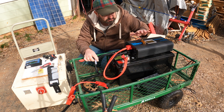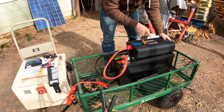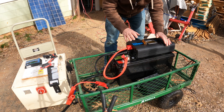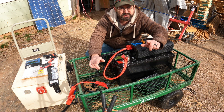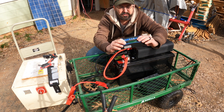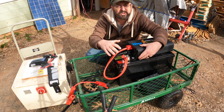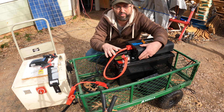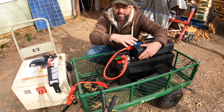We are now done with the system — we have a complete system. We can turn this on and power this unit. We could plug things in and we'd be good to go, but we have to charge it first. Remember, we're using a battery charger because we are not building a solar generator. If you wanted to build a solar generator you would need a solar charge controller and panels, but we're not doing that. What we're building is a portable power station — we charge it up using grid power so we have stored energy for when the grid goes down, for an emergency, for a job site, or for an off-grid cabin.